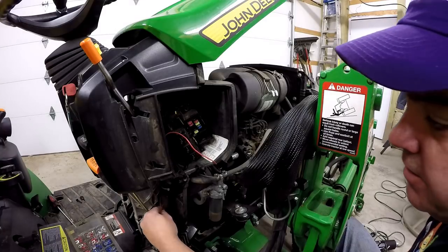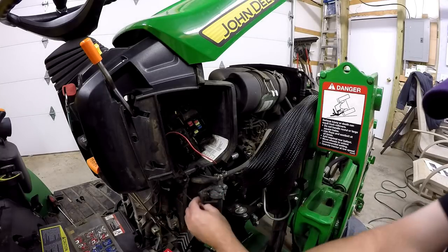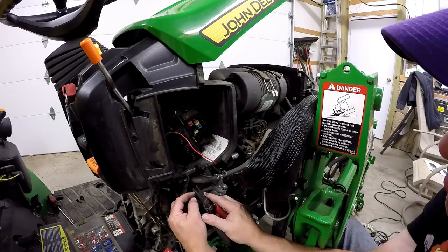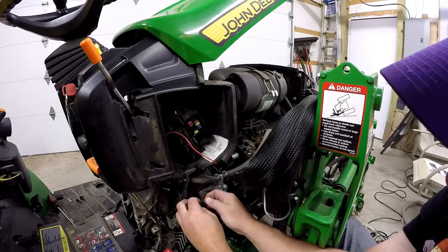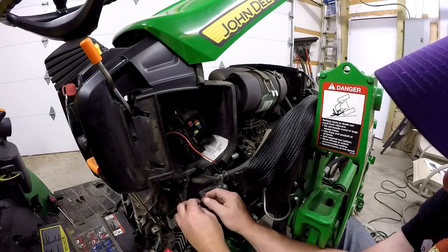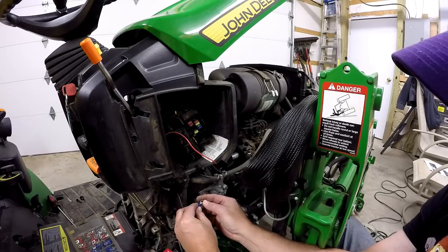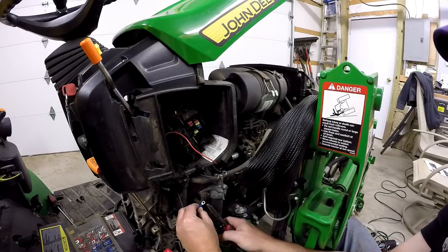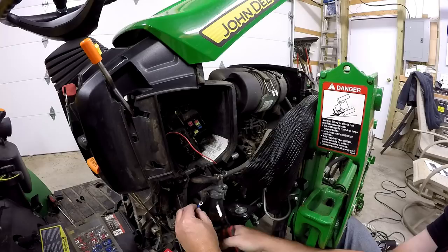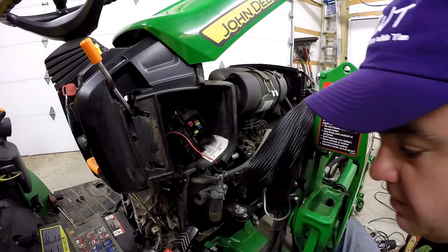Okay, I've got my wire cut just to the right length to hook to that bolt down there. Hopefully you can see that bolt that I'm going to hook to. I'll strip just a little bit of this wire off. It doesn't take very much. I always like to spin it just a little bit to keep it from coming apart. Here's my ring connector. Probably an antique ring connector. I can use the ends of my same stripper for the crimping, I guess because it's an antique, back when they made things simple and effective instead of complex. Look at that. Fits right on there.